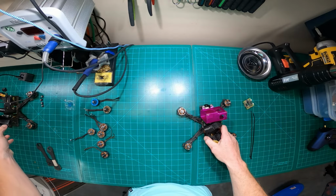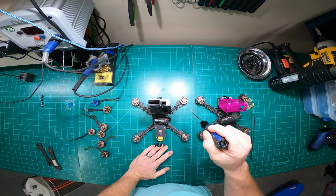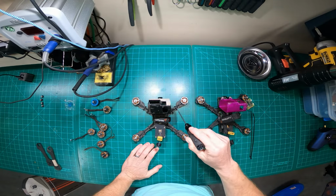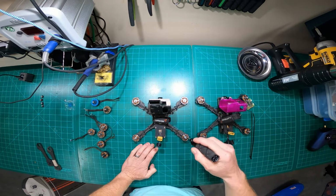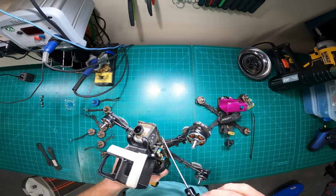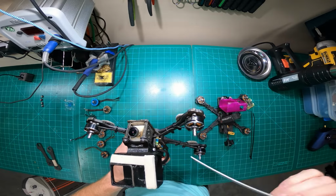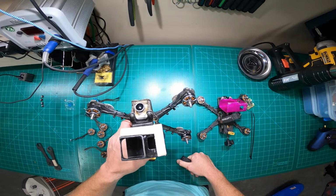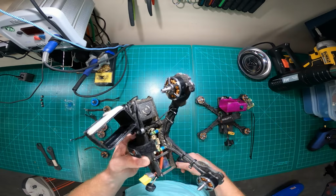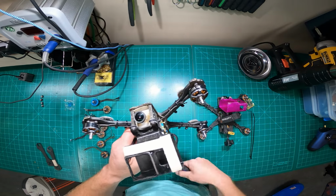Great question. One of the first things I see fail, typically besides the hardware components, are these antennas, the Crossfire antennas. I keep a lot of these on hand because I see them start to get chewed up and degrade, so I replace them every now and again. I find I'm replacing these every couple of months, and I'll start getting RSSI errors and signal noise errors even when I'm not that far away, and that's how I know the antenna's kind of served its purpose. I'll just replace them. They're real cheap, $4 or $5 a piece.